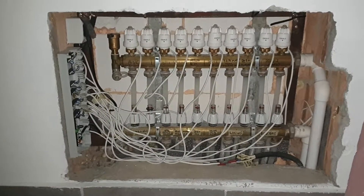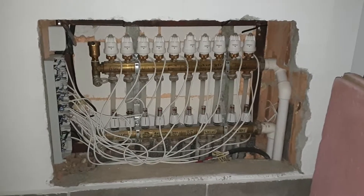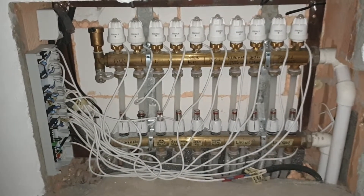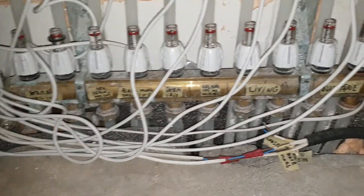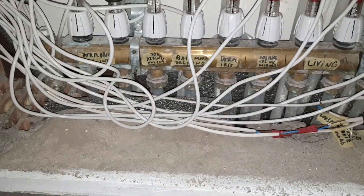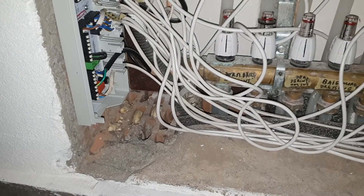This is an alternative to control heating — in this case, floor heating — via this panel. The model of the panel is this. You can see a bunch of cables; in the upper part we have the motors that open or close different circuits. The circuits are labeled: there are two for kitchen, two for living, one for a hallway, one for a bedroom, one for a bathroom, one for another bedroom, and two for yet another bedroom.